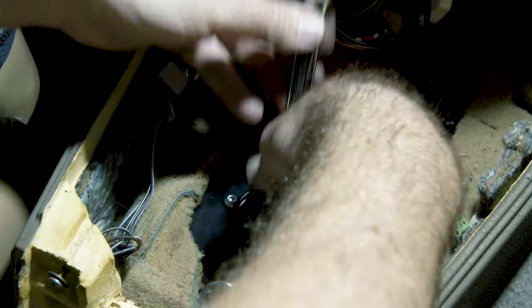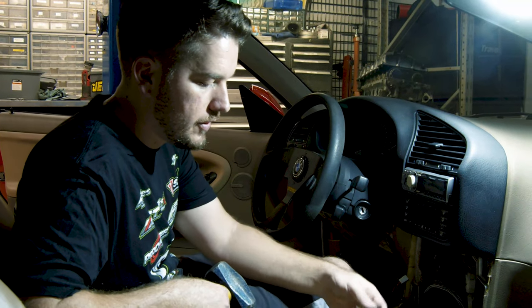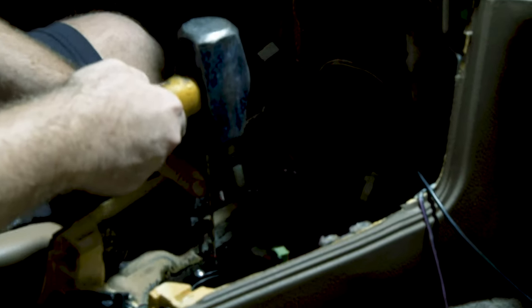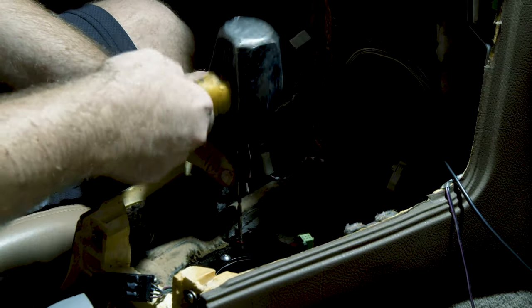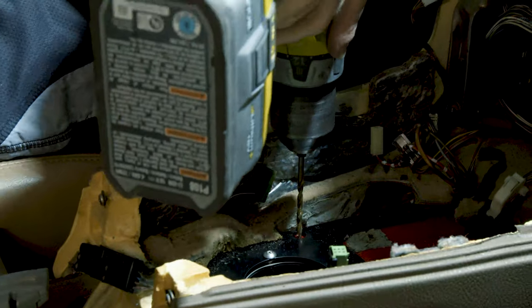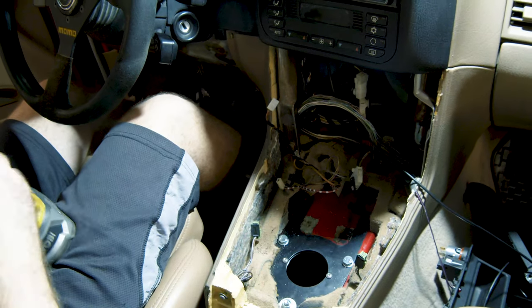From the bottom side we'll tighten down. After that we're going to be drilling our holes — we've centered it in the hole that's already there. We're going to use a smaller bit as a pilot and a punch. With the two middle bolts installed, we'll be drilling through the rest of the holes.